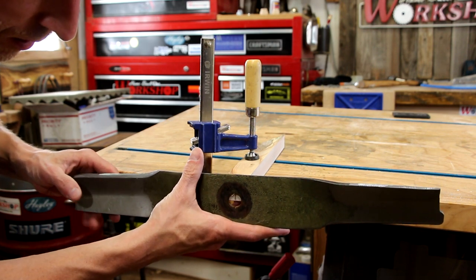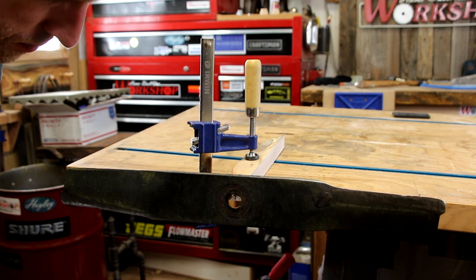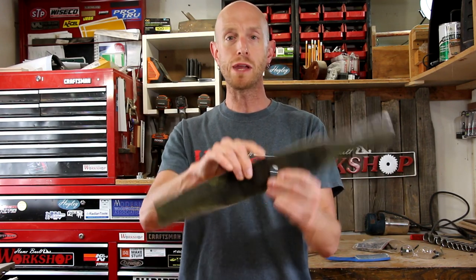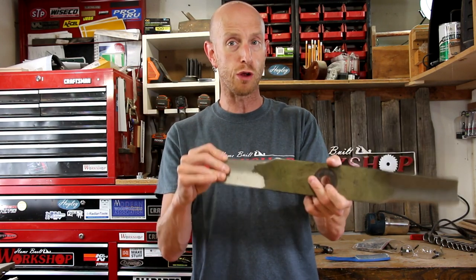I also like to flip it around in multiple orientations just to make sure. This is the method I was shown many years ago and it's what I still use. It may sound old school — pound a nail into a board, hang your blade, make sure it's straight — and you're right, it is old school. Some people feel this isn't the most accurate method, but that's also why I flip the blade four different ways while checking. There are also commercially available balancing tools that use a pivot and a cone-shaped housing, and those are perfectly fine. They're very inexpensive and I'll put a link in the description, but I'm just showing you how I sharpen a blade, and it's worked for me for lots of years.